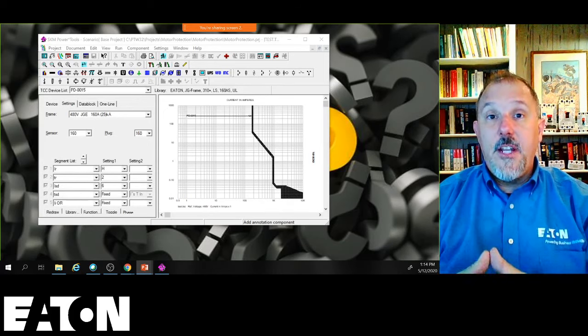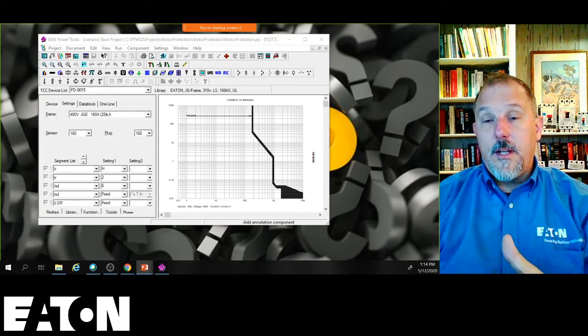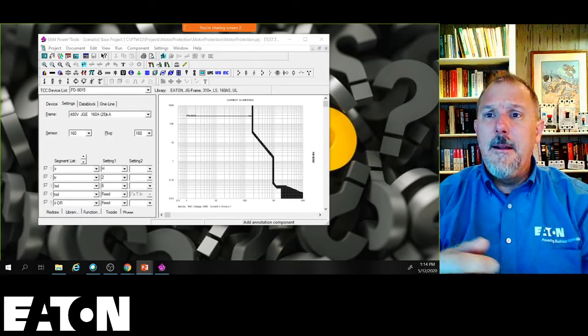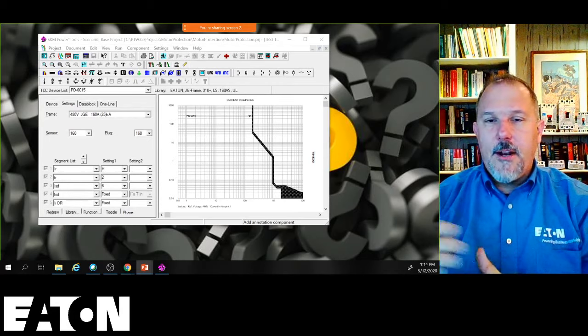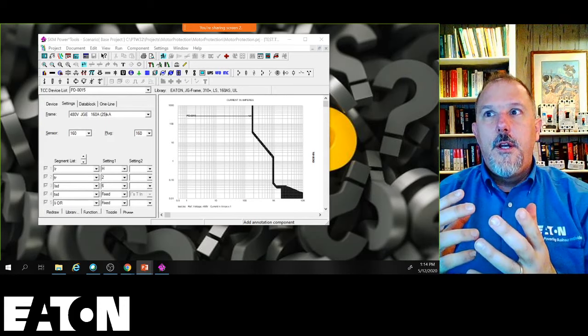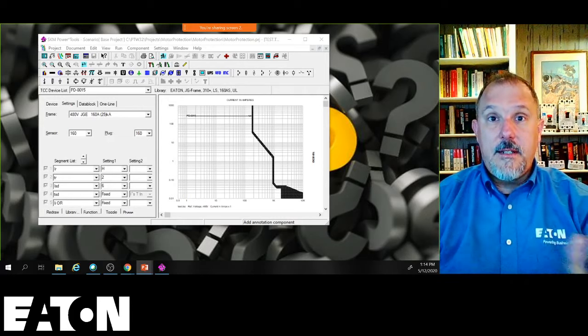If you do have a short circuit, if you do have an arcing event, an arc flash event or whatnot, I tried to design for that arcing. I didn't have IEEE 1584 at the time, but if you did, you'd say, if you do have that bolted fault current event, or something greater than that arcing current based on 1584, then you're going to probably cascade, and you'll have this cascaded outage. You'll have an extended outage.